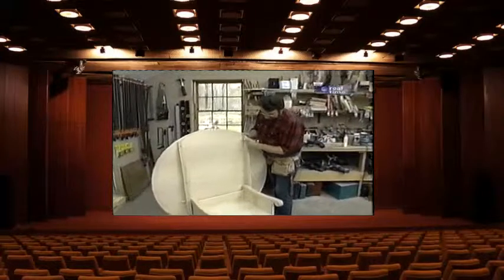Under the top, there's a couple cleats, and they'll help keep it flat, but more importantly, they're part of the mechanism that allows the top to go up and down. And they're slightly tapered on the ends. So I've taken some straight stock, laid out the taper lines, and I'll cut them over on the bandsaw.